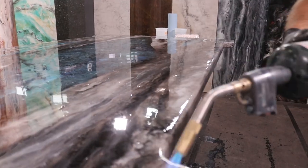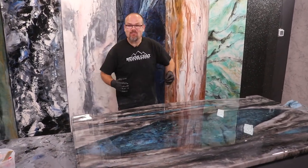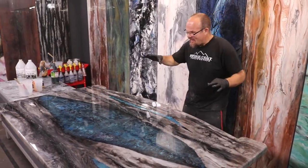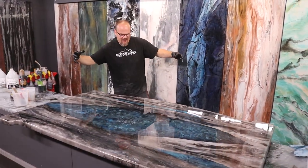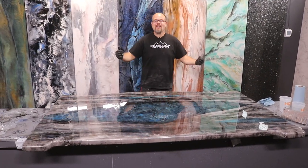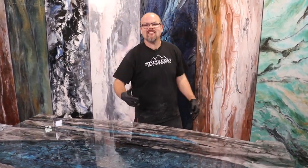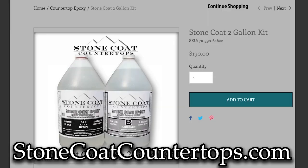As a final couple of steps, I'm going to use my hands and really wipe those edges with my glove. I'll look for anything embedded in the surface — a piece of dirt, dust, or a loose bristle — and use a razor blade or toothbrush to pull those out. I'm really pleased with how this looks — the depth and detail, the vein we put in yesterday, the transitions. This looks like one piece of stone morphed together by Mother Nature. My brother and I have installed granite our whole lives and this would be classified as super exotic granite. Visit us at stonecoatcountertops.com — you've got this!